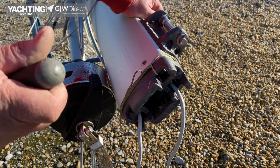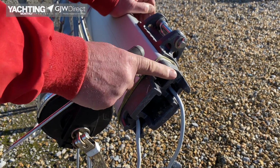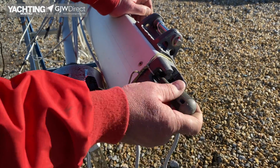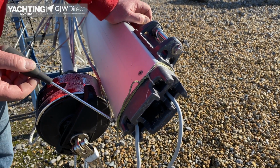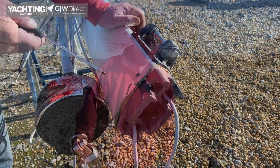It's very wet inside. A lot of water can run down the inside of a mast. This is cast aluminium, with an aluminium extrusion, so we're not expecting too much corrosion. There's plenty of room in this case, the water can come out. But again, it is possible that you get corrosion in this area, depending on the exact mast that you've got.